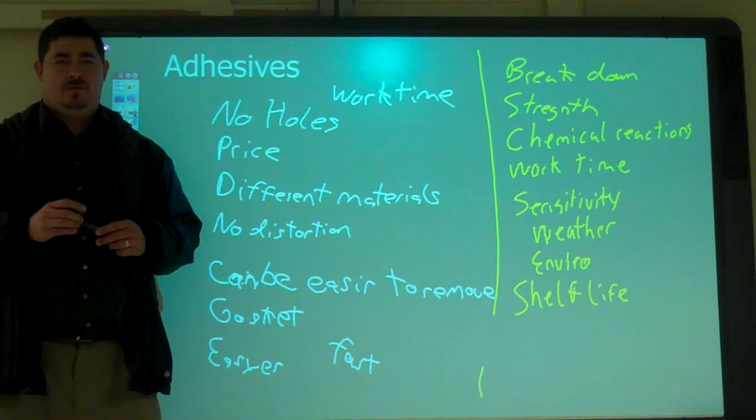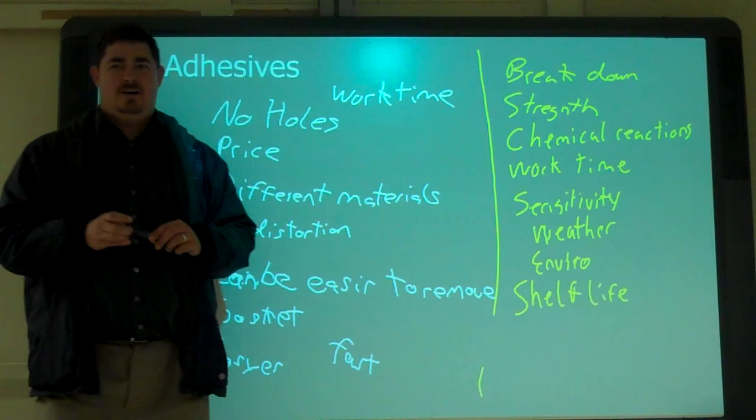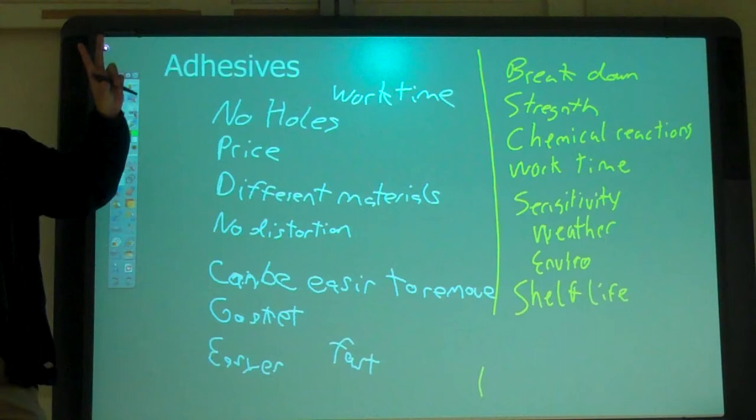So what about fiberglass? Fiberglass, yeah. That's two-part. Are we using epoxy there? Oh, yes. It mixes it up. The resin. What does the resin do in fiberglass? It hardens. And is it an adhesive in that sense? Yeah, because you adhere the mat to whatever. You stick the different layers of the mat together and hold the mat in its position, right?